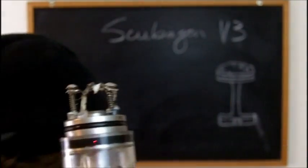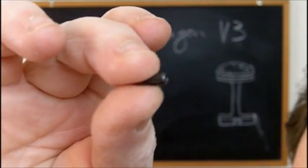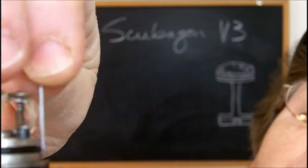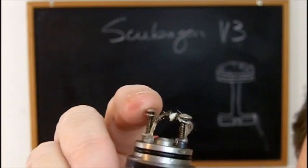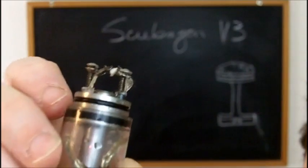I used this press fitting that they gave in the kit. I couldn't squish it to hold onto the nail. I couldn't figure out how to hold onto the nail. So I pounded one into this, and then I cut up some little strips of aluminum from an aluminum soda can. Then I took the nail and pounded it down in there to make it have good contact. And then I put some silver solder on it to hold it in place, and that's how that's held on. Now that sounds all easy, but this took me forever. So there you have that.